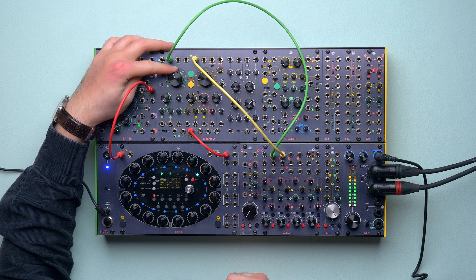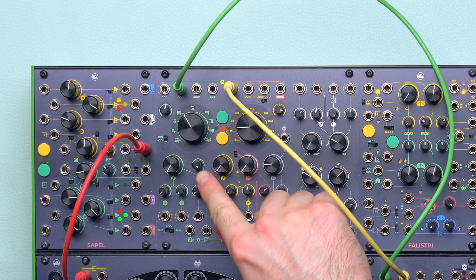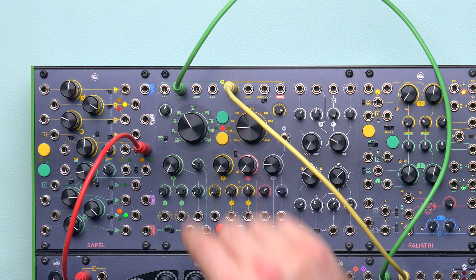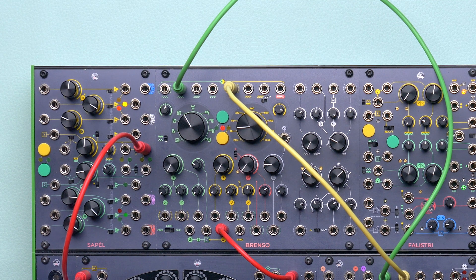We call sync sweep the technique of dramatically modulating the secondary oscillator's frequency, thus achieving a sort of sweeping sound. We can do it in at least three ways. The first one is playing with the knob — it is the most fun to do. But sometimes we may want to use our hands for other purposes; we can thus use the internal integrator, which we talked about in another video. It creates a glissando effect on the volt per octave signal that we patch to the first oscillator. However, since it is a linear integrator, it moves at a fixed speed defined by the knob, and it also depends on the intervals we play. Wide intervals generate wider sweeps and small intervals generate smaller sweeps.